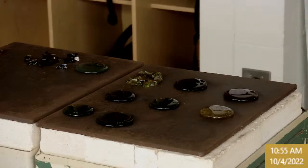Great internship position there, right? The proportion of cullet in glass can be as high as 90%. Cullet melts at a lower temperature, so for every 10% of cullet in the mix, the factory uses up to 2.5% less energy to produce its glass. Now that is a clear incentive to recycle.